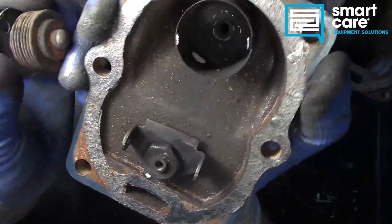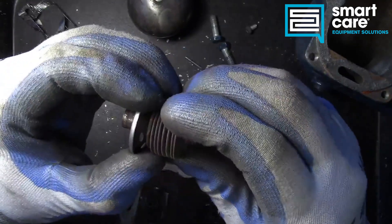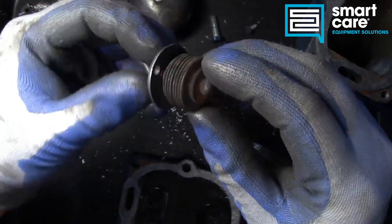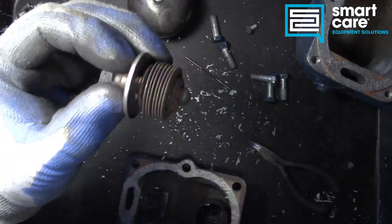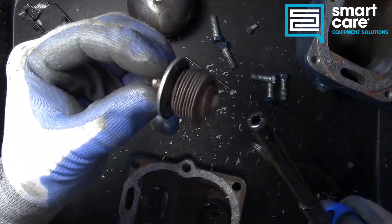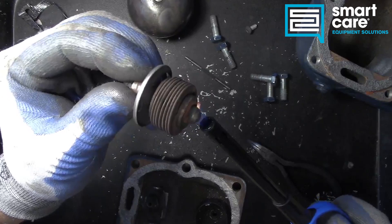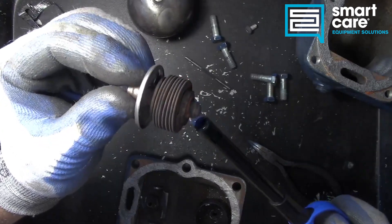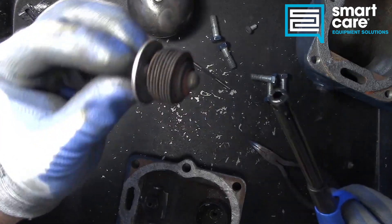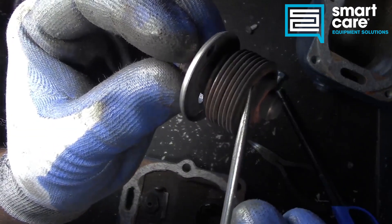You can see it's got a similar seat down inside. That thermostatic bellows is like a bimetal material and it expands and contracts. Think of it as being open when cold, and then when the steam comes through the system and reaches the trap it heats up and closes. Testing heat on it — the bellows is actually broken. You can see it's starting to expand but the bellows is burned through. It is starting to fail.